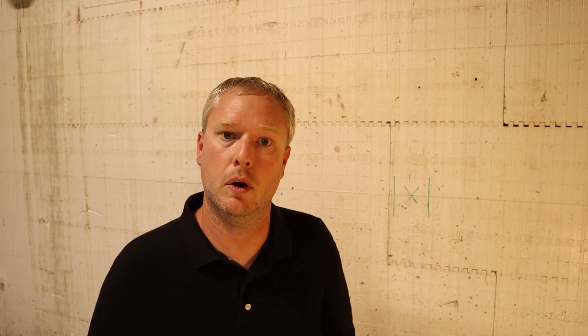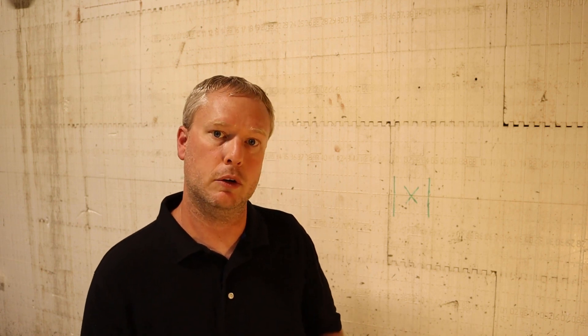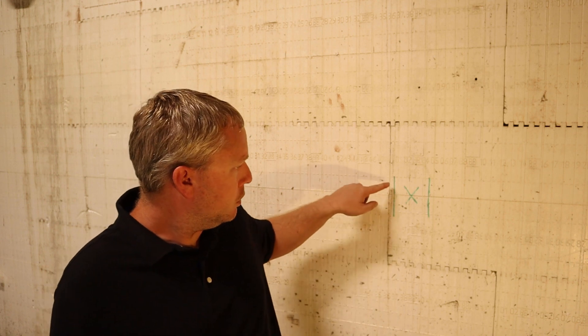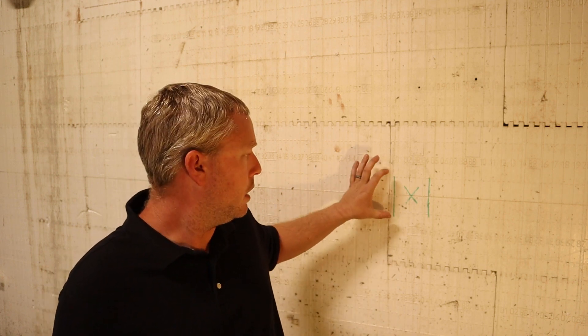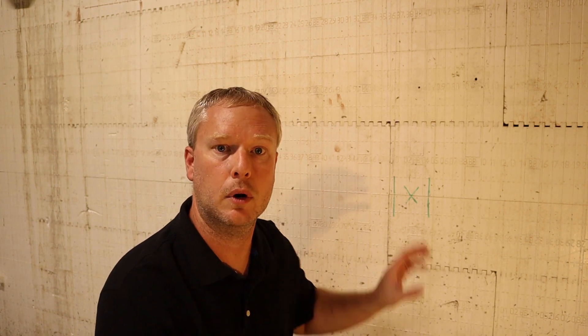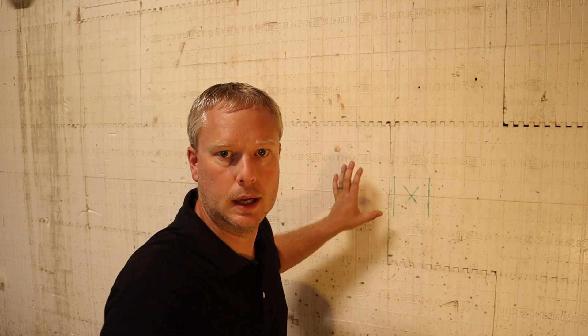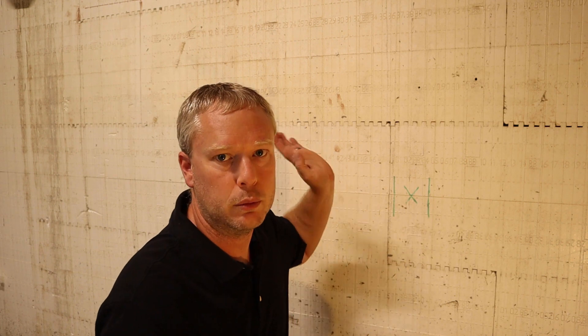When you have the information from your manufacturer, you should know the spacing and where it actually starts — you should have an actual truss plan. When you do, you're going to want to build your blocks about three high and then mark where each truss is going to be. If you mark where the trusses will be before you put up any bracing, your bracing won't interfere with those brackets and you won't have to move any later on. Then go ahead and put all your bracing in place.